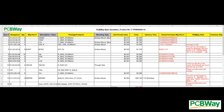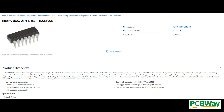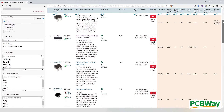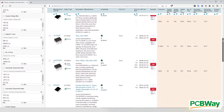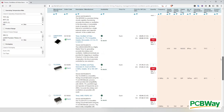This is my first experience doing this, and it took quite some back and forth to work it out. In particular, the timer ICs in this design was a big sticking point. The original MERG design calls for four 556 dual timer ICs, a sensible choice when thinking in socketed through-hole terms. However, when moving to surface mount, the advantage is not in the 556's favour, as 555s are common components and thus cheaper, and 556s are not.